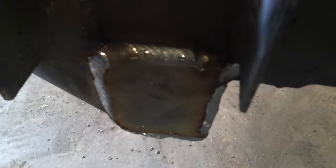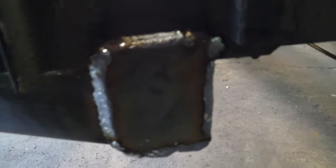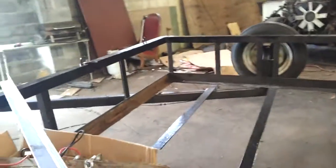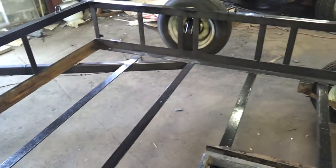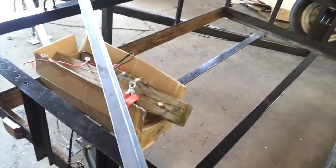That spare tire is in the way. Over on this side, it was cut at a 65-degree angle to meet into the crossmember, then cut at an angle on the side and plated, completely sealed on the end. It's welded all the way across, on both sides and across the top — very, very strong. The owner originally just wanted to tie it into the first crossmember, but I didn't think that was going to be strong enough. So I made an executive decision and brought it all the way to the second crossmember and to the outer frame rails where I knew it would be much, much stronger.